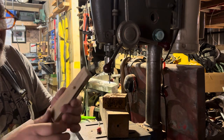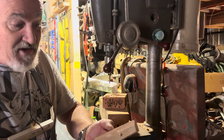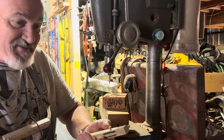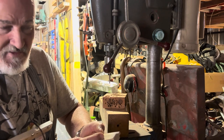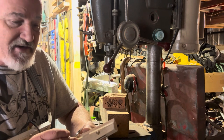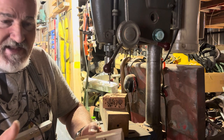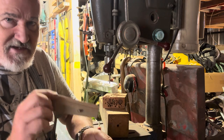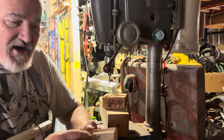The next step after that is really important: when I start grinding these, they're going to grind off flush. Don't make the mistake of putting this on your grinder and just start grinding it. You have to continually — because you've got the handle epoxied on — if you start heating this up it's going to let the epoxy go and the handles will delaminate. So as I grind these I constantly keep water on them, dipping the handle in water to keep them cool.